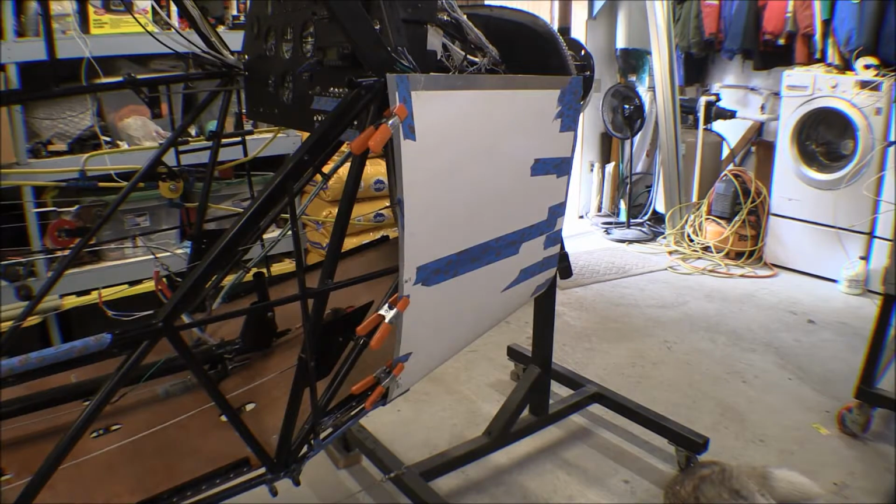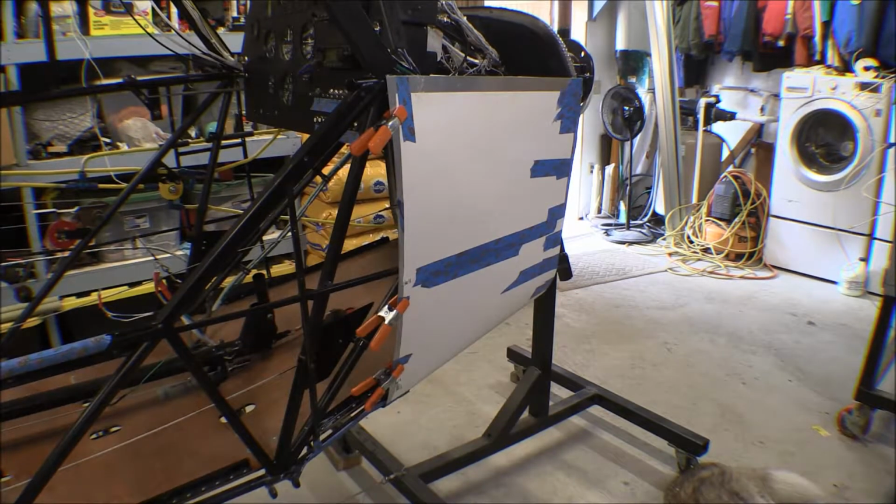We've got the aluminum put up there. The pattern is still attached to it with masking tape, but it's on there. It's bent down there on that lower longeron where it goes around that relatively tight bend. We've got it out about 1/2 inch from the back side there where it goes over that Piper channel. It'll be trimmed up a little bit once it gets on there, but it's a pretty good edge already. The front is flush with the firewall. It's clamped up there and taped up to the front.